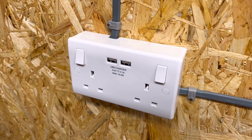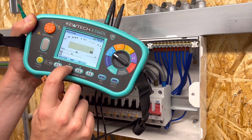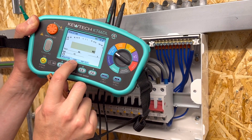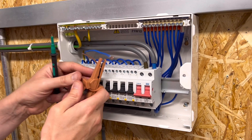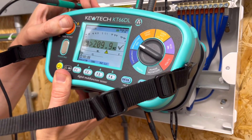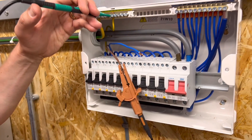Now, while this doesn't specifically mention sockets with USB chargers, the principle could be considered to cover them. So you could have set the tester to 250 volts and carried it out, and as long as you are over one megaohm, you are all good. However, this in all likelihood would be good for the tests between line or neutral to CPC, but when it comes to testing between line and neutral, a USB charging socket would give a reading of about 0.2 megaohms. This was kind of got around for a while by various bodies in the electrical industry by allowing that this value is acceptable, as it was a known value on the circuit from the circuitry inside the socket outlets.